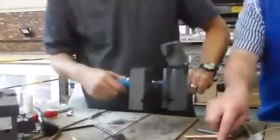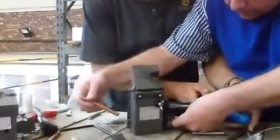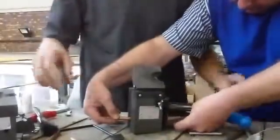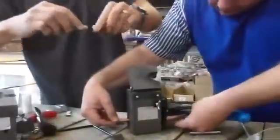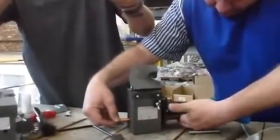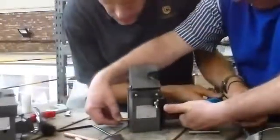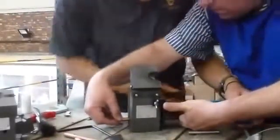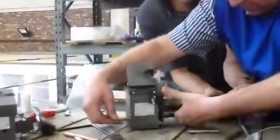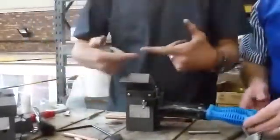Here's the cap of the mold. You close it slightly and leave about a 2mm gap between the conductors so that the weld metal can flow in between the ends of the join as well. Then we clamp it closed — there you go. The ends are positioned there.